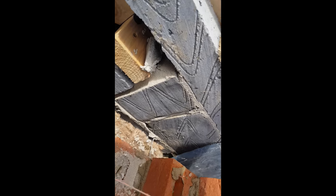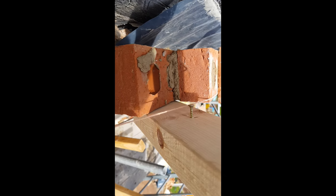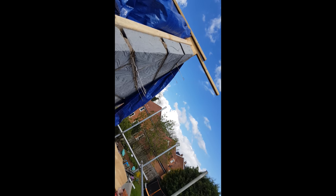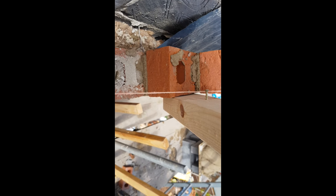This timber wants to be flush with two rafters. The timber wants to be square and flat against the brickwork, and then we just hook a line on that pin all the way up, which we'll put another hockey stick at the top, and that'll give us our cut up at 225 down.